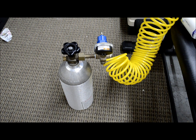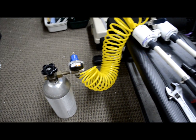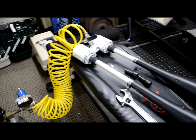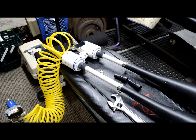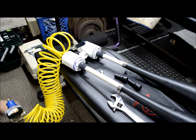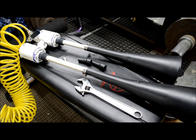Keep in mind this is going to be a portable setup — not intended for long-term permanent use — so it's not performing at its full potential, but it gets the job done for my purposes. I plan on painting them to make them look a little bit nicer. Let's give them a quick test. You obviously won't be able to tell how loud they are in real life from the video, but this gives you an idea of what they sound like. I'm only on about 55 psi — pretty low pressure. Pretty good — a little bit more pressure and they'd sound even better, but my regulator is limited to 60 psi, so I encourage you to use a little bit more than that.